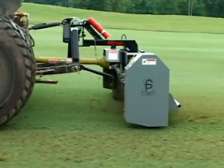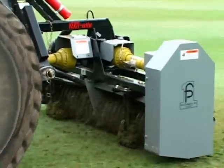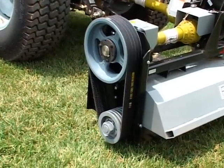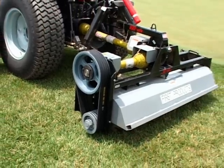The VC-60 uses 5 BX belts to transmit torque to the blade shaft, providing extremely smooth and quiet operation. No chains to break or sprockets to overheat. The combination of 5 belts along with a driveline jack shaft provides a smooth torque transfer, resulting in less maintenance